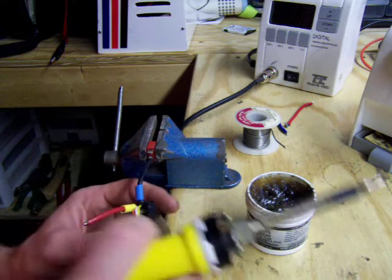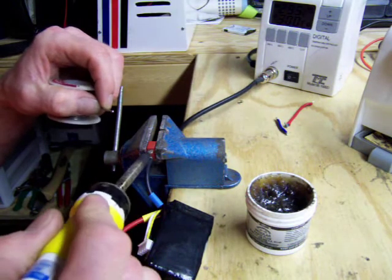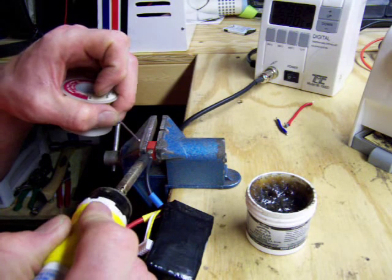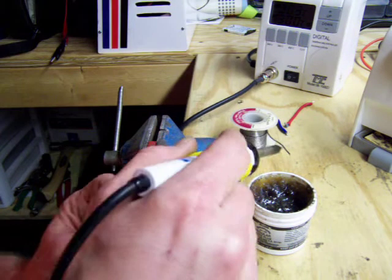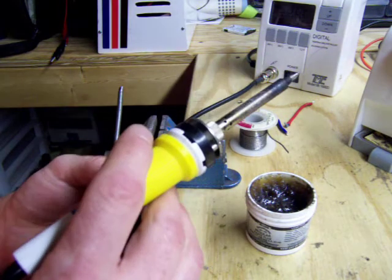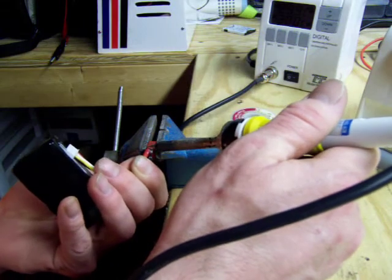I tinned the wrong side of this one — I usually put the wire on the outside. So I'll go ahead and get that warm, apply a little bit of solder. A little more solder on the tip of my iron — that helps the heat transfer.